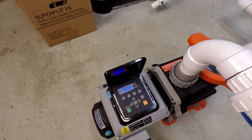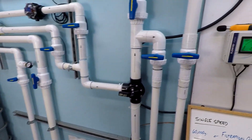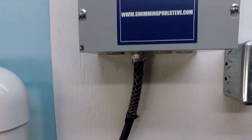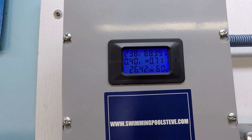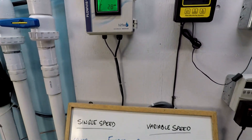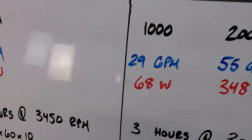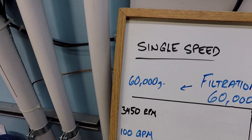Let's go ahead and show 1,000 RPM. At 1,000 RPM, if you didn't have a flow meter you wouldn't even think it's moving water, but it's actually moving a ton of water. At 29 gallons per minute — it's like 28 and change, so it's just showing 28 right now. 68 watts of power consumption. There's our number. So let's go ahead and talk about these numbers — we want 60,000 gallons after 24 hours.